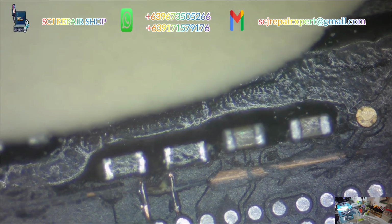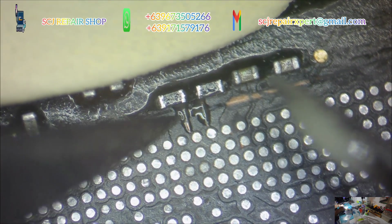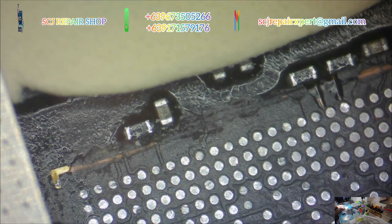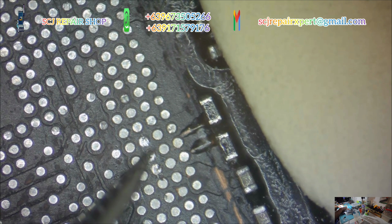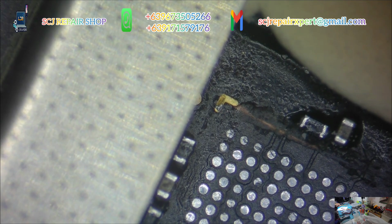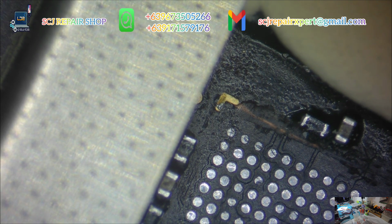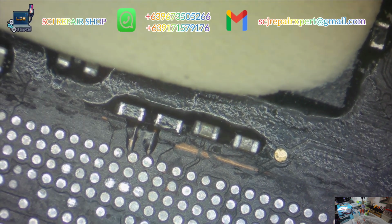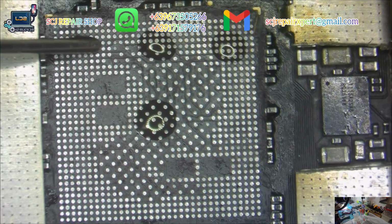Alright. After putting in jumper wires, I covered them up with UV glue to prevent any electrostatic discharge that could severely damage the chips. Okay, I'm 100% confirmed that there are no lines left floating. So let's install all the chips one by one and see the result.